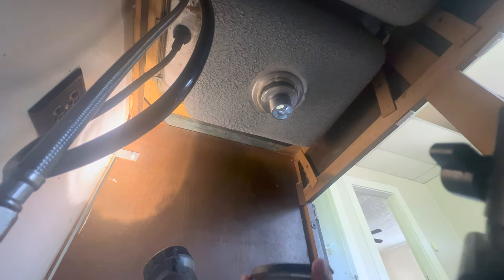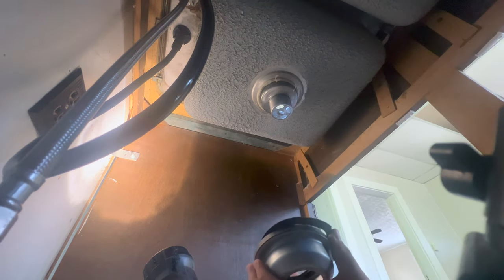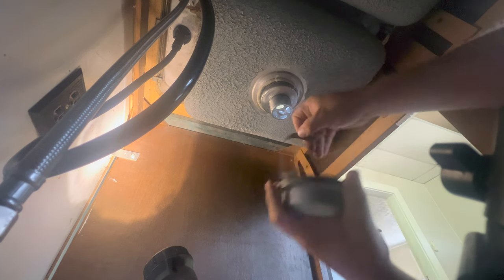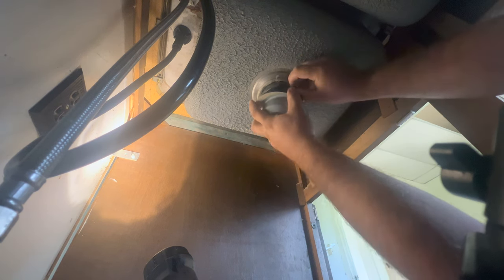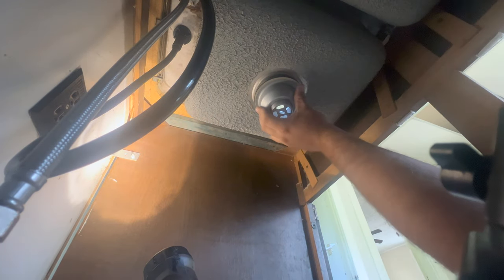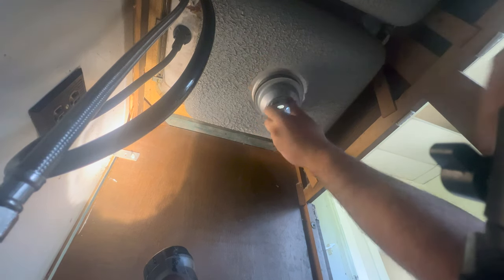So we're down here now. Remember this particular basket strainer — they're all a little different — but this one came with one small flappy rubber, a thicker rubber, and then your friction washer which is just made of paper, and then the nut. That's the exact way that it goes on. Here's some of that plumber's putty that we have — we actually might have too much, but we're going to put this on here. This little friction washer is just going to go bye-bye; we don't even need it — most of them don't have that. You put all those on in that order and screw your nut on.